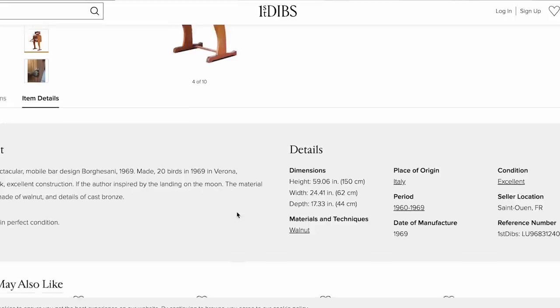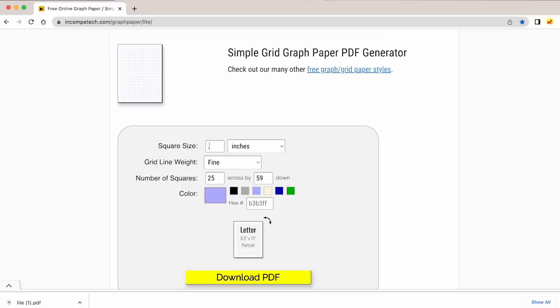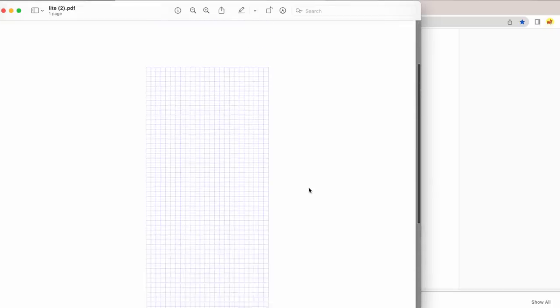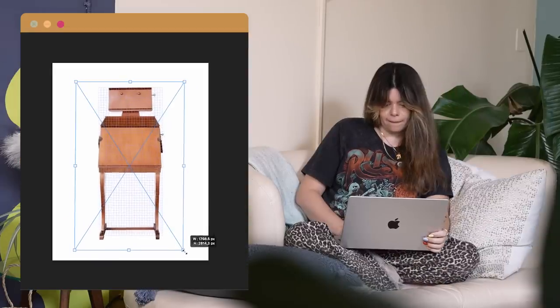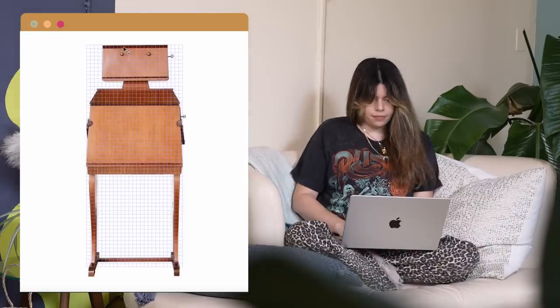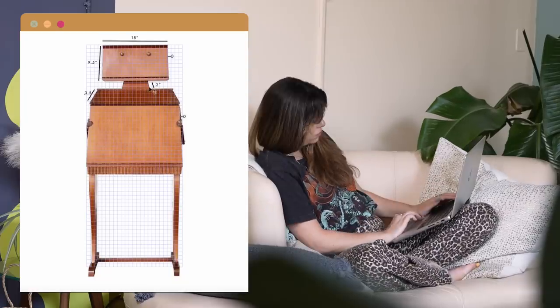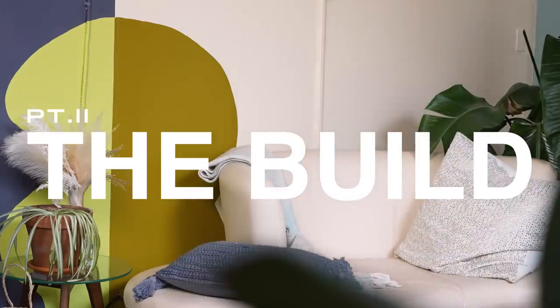But luckily, the listing for this bar that sold on First Dibs is still up, and there are some rough dimensions in the description. From that information, I'm able to take a photo of my source bar and then place a grid over top. I can make my grid as tall as I know the overall bar is, and from there, I can break it down into inches to figure out exactly the scale of each separate part of this robot bar. With my grid correctly scaled, I went in and just started counting the squares and drawing my numbers. With this method, I can break down any part of this that I want and get a fairly accurate dimension of how big it should be. So now that I've got all these dimensions worked out, it's time to move on to the build.